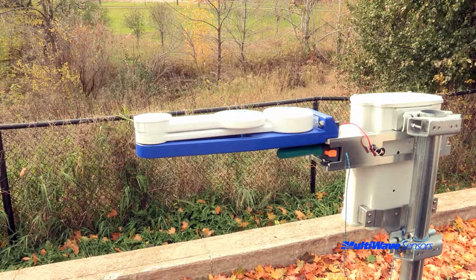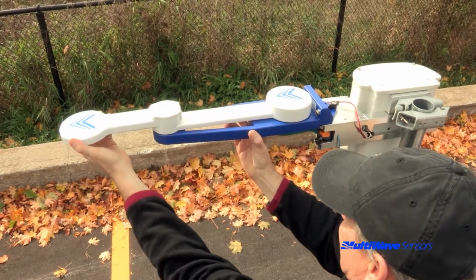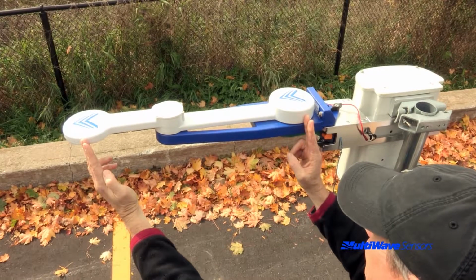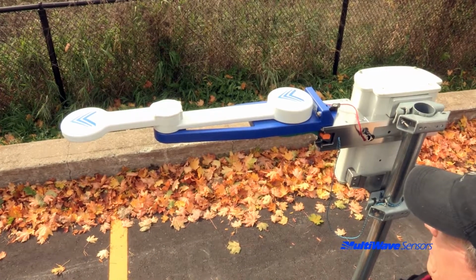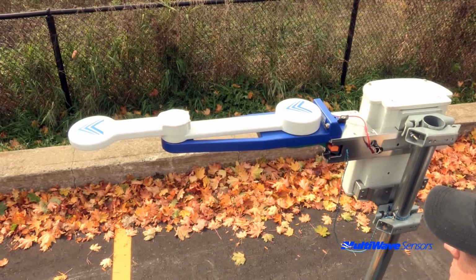When the arms are in the storage position as shown, the tool is very compact. However, GPS compass tools have superior azimuth accuracy when the GPS antenna elements are separated by 0.5 meters or more. When the arms are deployed, the GPS antenna elements are separated by 0.5 meters and the Smart Aligner tool is capable of 0.5 degrees of azimuth accuracy or better.